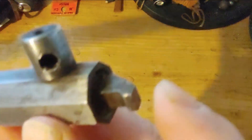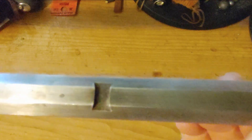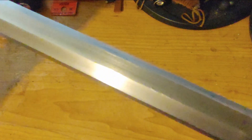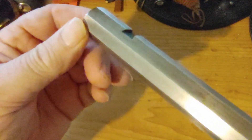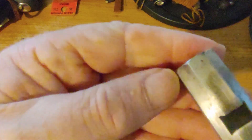I still need to clean this end of it, but I'm not going to worry about this end of the breech plug because that is hidden. As you can see, we got it pretty well there — there are a few spots. There is an area right here — you can see it's been peened over, someone must have banged it against something. There was one here but I filed that off, and that's the only spot that has it. I'm going to be filing that to where it's smooth.